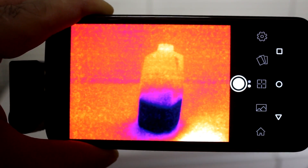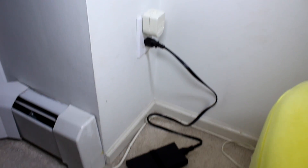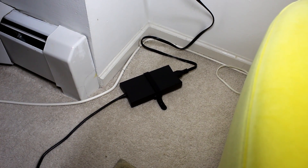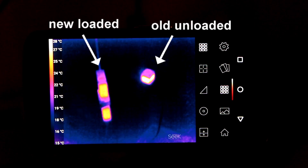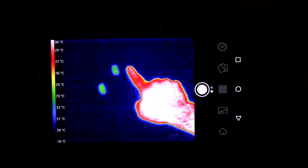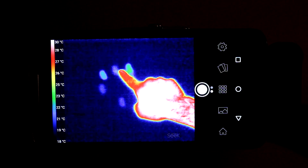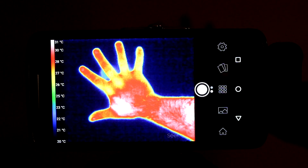This camera opens your eyes to a lot of new information that could be very useful. For example, you can easily figure out what devices are wasting energy at home. I have two wall adapters: one is 130 watts maximum powering my laptop, and another is 50 watts not connected anywhere. The older technology adapter, although not connected, is getting warmer than the new switching supply under load. With a good thermal camera you can even figure out which keys were pressed on a keypad and their order by seeing which ones are hotter — so thieves use it to figure out your PIN. You can get around it by randomly pressing extra keys or pressing everything at the end.